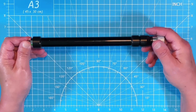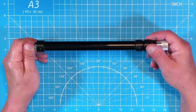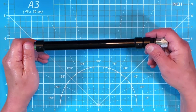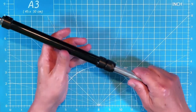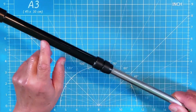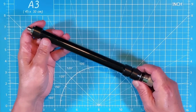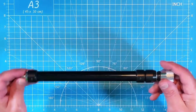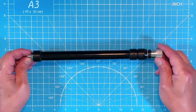I'm not 100% certain what's happening here. I've chosen not to take this apart yet because I want to operate with it first. I have a hunch that at the top of this steel rod is possibly another collar engaging a coil on the inside of this sleeve, and that's what's lengthening and shortening our antenna. I'm not certain — we'll figure that out at some point. But I think what we have here is a very small, lightweight version of the Super Antenna or the Wolf River coil.